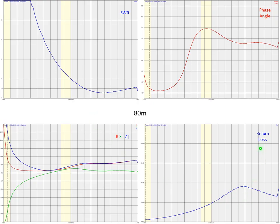And then this reading is what we're going to be using down the road to quantify the difference between the antennas, and it's return loss. If you're not familiar with it, basically it's a measurement of the reflected power coming back from the antenna. It's kind of related to standing wave ratio, but this is a quantifiable value of the percentage of power reflected. So if you're reflecting the power, you're not getting it out the antenna, and the way the math works, you want a high return loss value, meaning that you're getting very little reflection back from the antenna, and most of it is being propagated. So this is a real key thing that we'll get into to understand how we can quantify the difference between the two antennas.